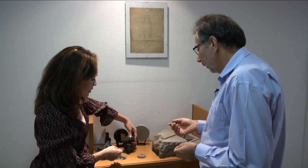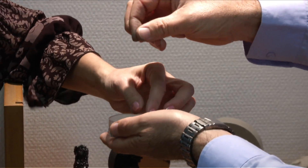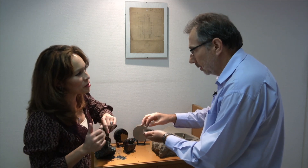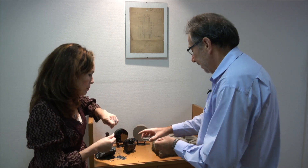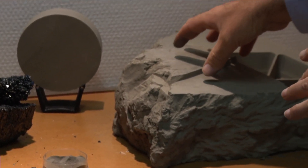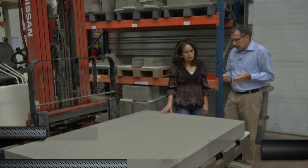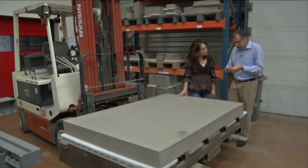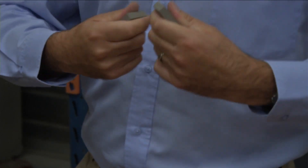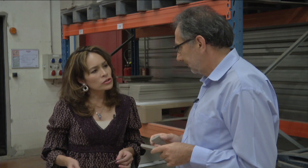We crush the raw silicon carbide into fine powder, typically one micron in grain size. There is a further step where we press this powder into blocks. We have just got the blank for the NIRSPEC base plate. This material is still very brittle and feels like chalk or chocolate — it can be broken by hand and is easily machined because the material is soft. It is not yet a ceramic; it will become a ceramic after being sintered.